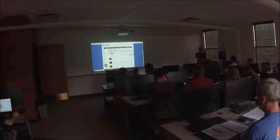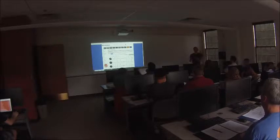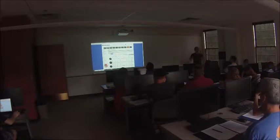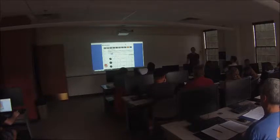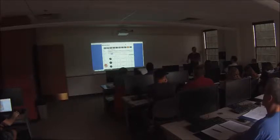So what's on your screen has to make its way somehow to fruition in the real world. You have to be able to take metal or plastic and do something to it to make it end up in the shape that your CAD model shows. It is easily possible to model something that there is no way to make in the real world. There are shapes you can make in CAD that you can't make in the real world, especially in our case, where we don't have access to crazy metal 3D printing. We've got a nice set of tools, but it's a fairly small set, and we have to model things that can be made by those methods.